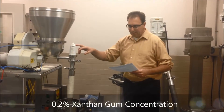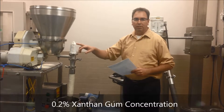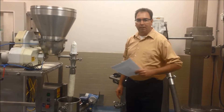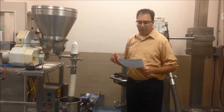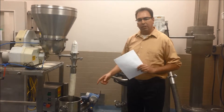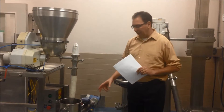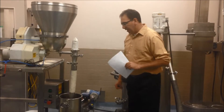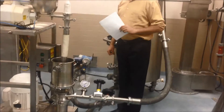The feeder is currently set up to deliver 0.6 kilograms per minute of powder. We've got 80 gallons a minute, which is basically about half the flow rate you'd want in production. In a production environment you may get a ZC 3 — currently we have our ZC 1 model here, so we'll start up the test in a second.